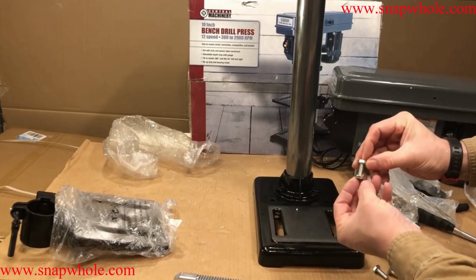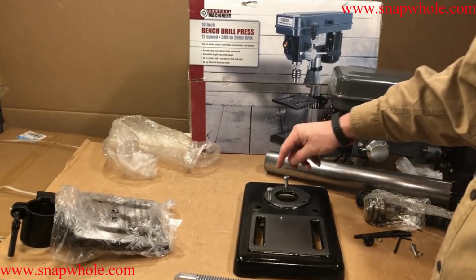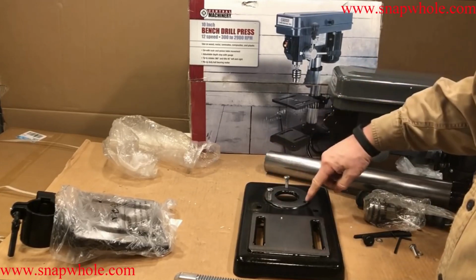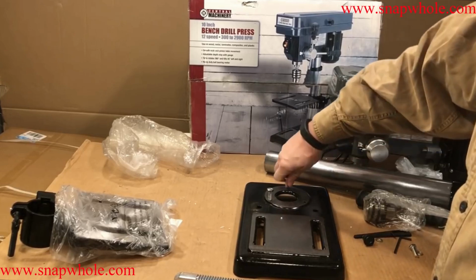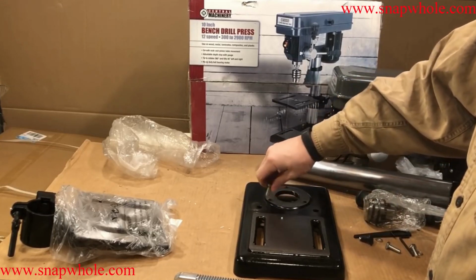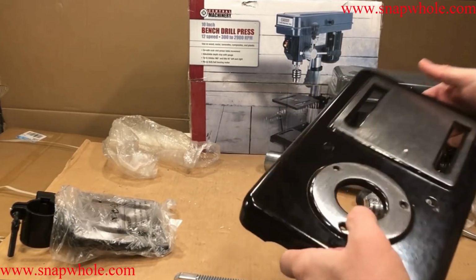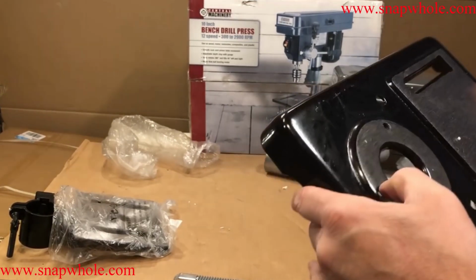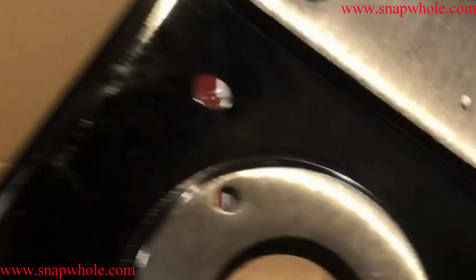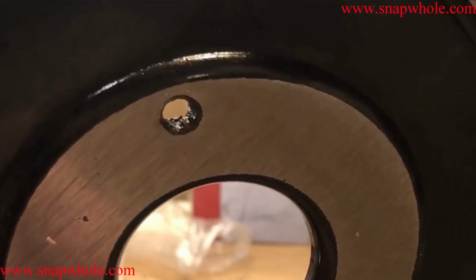I'm going to use the bolt with a spring washer on top of a washer. Okay, the bolts will barely go in because there is debris in the threads. Well, there's a couple ways to deal with that. One is I can get a wrench and drive those through, or I can get a tap and die, or I can get a tap and clean them out. I don't know if you can get that on camera, but there is so much debris in there, it's not funny.